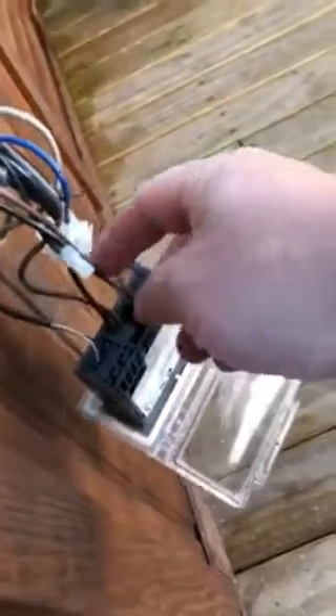On your contactor, you've got a coil on the outside here. The top and bottom one on this case - this is a Hager 425, I think. Basically it's a 230 volt coil, because I'm switching 230 volts here. And it's 230 volt output, so it's single phase. But I've got a four pole because I want this thing to last for a long time.